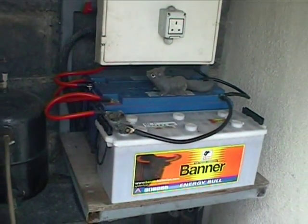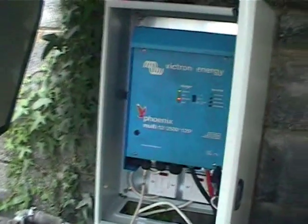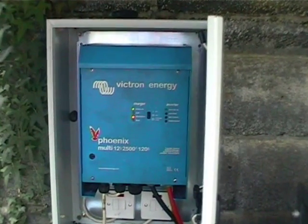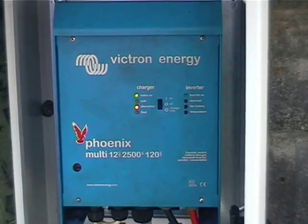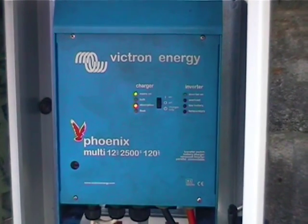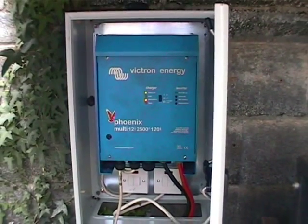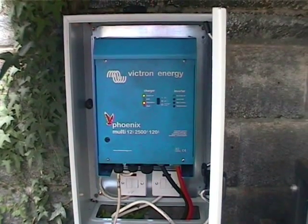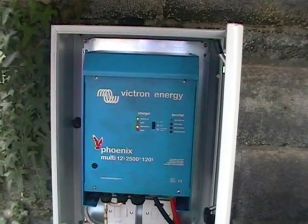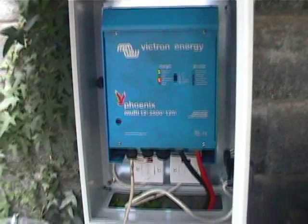So I'm going to be expanding the system to incorporate this inverter charger that I have here. I got this — it was actually faulty. It was several of the H-bridge transistors blown in it. And it's been about 60 quid getting parts for it and a couple of days fixing it. And this is actually the first pretty serious test that it's had.